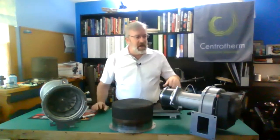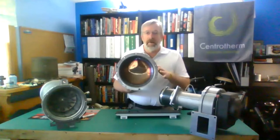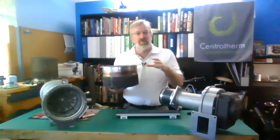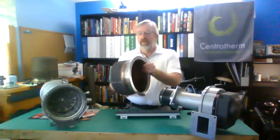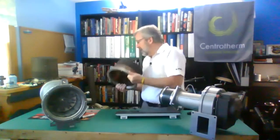Let's talk about the parts. This is the single burner model. There may be a small notch in your version from the original design which used a pilot valve for that low-to-high gas valve transition — that wasn't reliable enough, so the running line change was to re-spark instead. Every boiler in the field has had a new board installed to handle that. If the pilot gas valve is still present, you can remove it and plug the port, or leave it in place — there's a shutoff valve so it's not doing much. Cleaning this burner thoroughly is really important for a good PM.